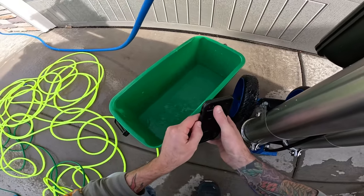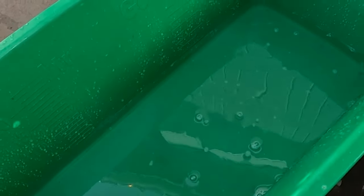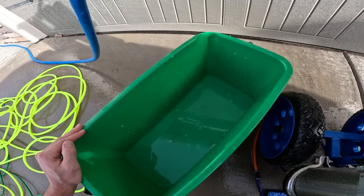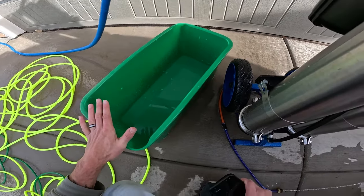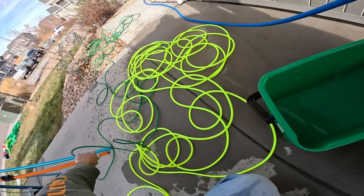After one minute, we're just right below one GPM — exactly what I expected with it being cold out. RO systems don't push out as much water when it's cold. So we're doing just below one GPM from the system. The real difference will be what rate you get after going through 100 feet of hose.